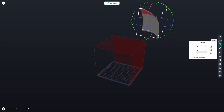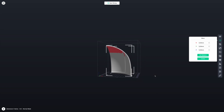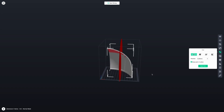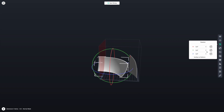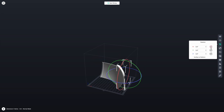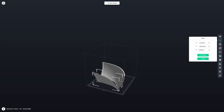Now to the back part. This part is best split again. I cut it close to the line — you can see going down back there. I try to align it as closely as possible, and make my cut. Then I rotate the two parts to make them print as nicely as possible. This biggest part doesn't need supports. You could add some to the smallest one if you feel inclined to do so. I played it safe and printed the small one with supports and both with a brim as well. After all of this half was printed, I did it again to the other half.